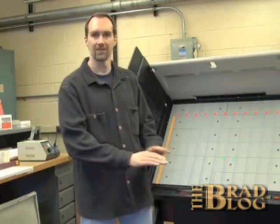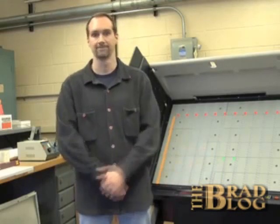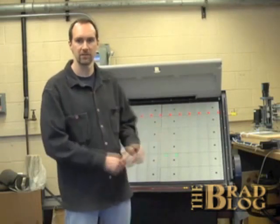Note that the sub-panels are interchangeable. If, for example, we were to put our tampered sub-panel one position higher, then G15 and H15 would be swapped instead of G22 and H22. Also note, there's nothing special about G22 and H22. The assumption was that candidates for a given position were listed horizontally, but they could have been listed vertically and we could have done the same attack — all we would have to do is slightly modify the wiring on the tampered sub-panel. Slight changes would also allow the swapping of votes between multiple candidates, not just the two demonstrated here.